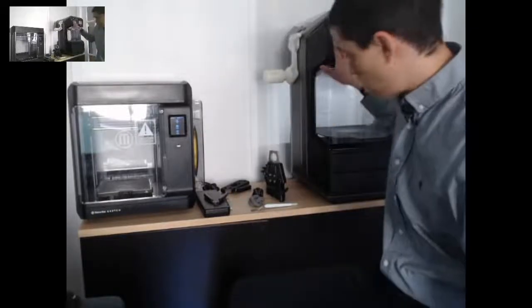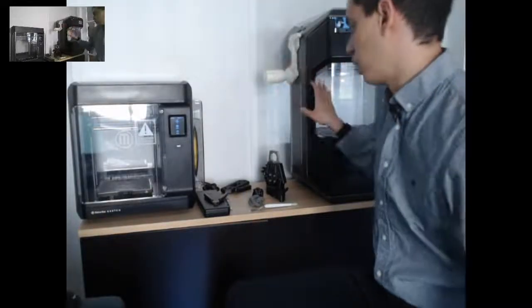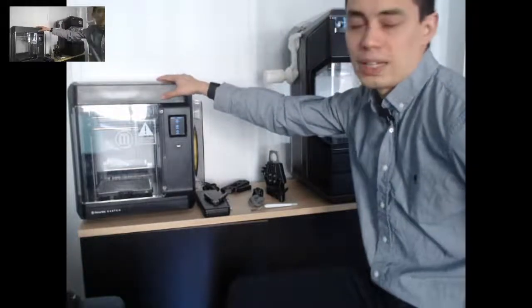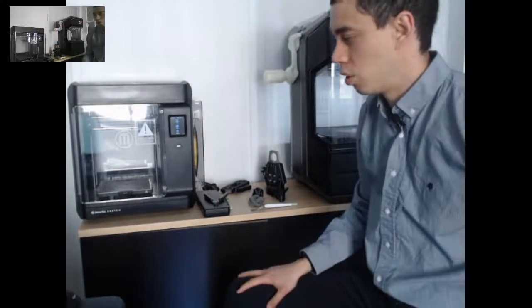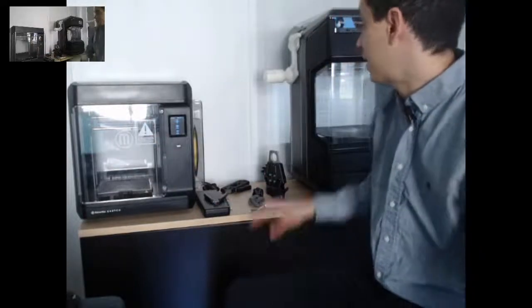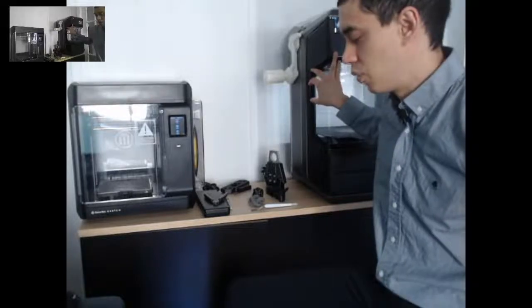How do you balance getting enough airflow and filtration in the enclosure without impacting the quality of print due to cooling of the material bed too much? Okay, so essentially we have two systems here, right? With Sketch, the enclosure is completely sealed, so there's really no active air being drawn into the printer, and it's just keeping a little bit of that heat inside by being enclosed. It's not hermetically enclosed, but it definitely has the shields. In Method's case, we are actively controlling the temperature, the air, and everything within that system.